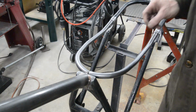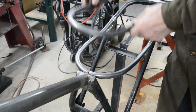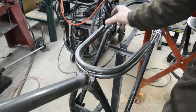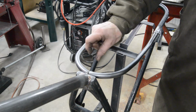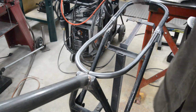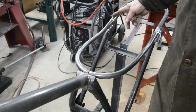It's even worse than trying to bend sheet. And well, my first effort, when I thought I'd measured it right, as you can see, is miles out. It's like 3 inches on each side. Then I discovered, I gave myself, I thought, plenty of tube, that you've got to sort of lead into the bend. It tells you in the instructions how to work it out and make templates and things, but of course I had to have a go straight away. So what ended up was, as I'd hoped, this end was long.